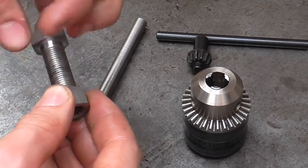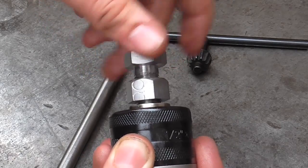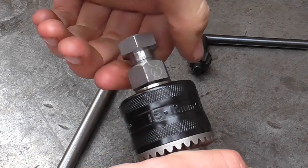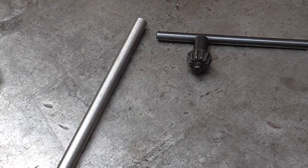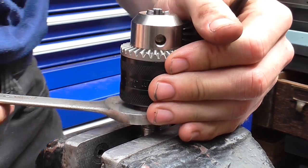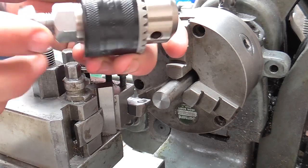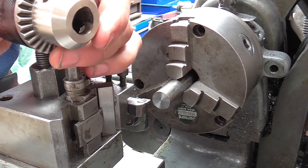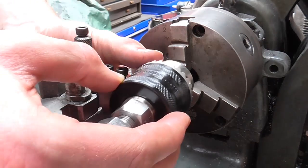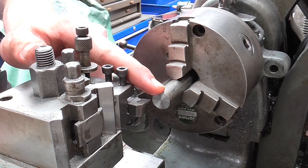To assemble it, it's very straightforward. I'm going to tighten that right up and then screw the lock nut in. Now that's on, we need a reamed hole up the middle, and the reamed hole wants to be concentric with the jaws. The best way I could think of doing that is to machine a diameter here so it's concentric, then lock the chuck on and drill the hole. I'm just going to skim this diameter so it becomes concentric.